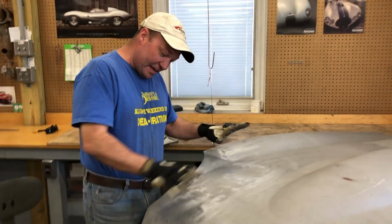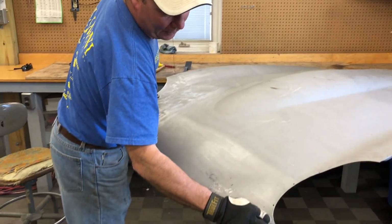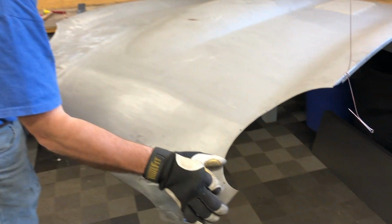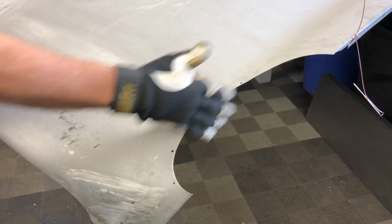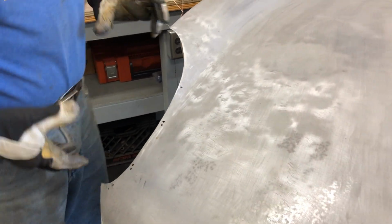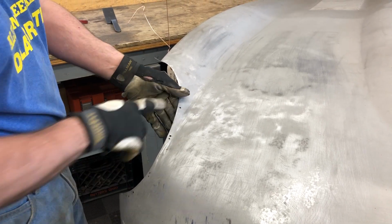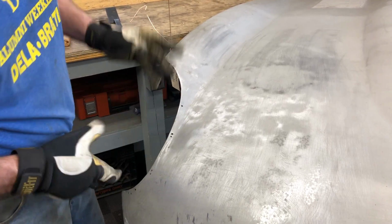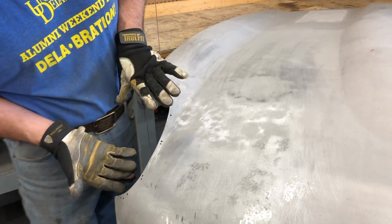And then the last thing I'm going to mention is, when they did this repair, the standard Series 2 headlight bucket is riveted in 4 places here with these little button head rivets that also hold the chrome. God, I'm out of breath, I'm trying to talk so fast. You can see over here, after this wreck, classic maneuver. Instead of trying to shape the metal and get everything perfect so the bucket fits where it used to, they just re-drilled new holes. And now, you can see how the bucket is all cockeyed down here.